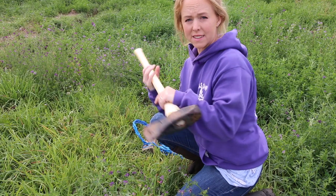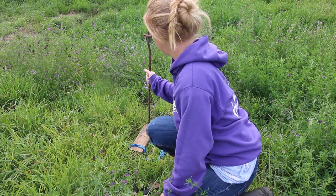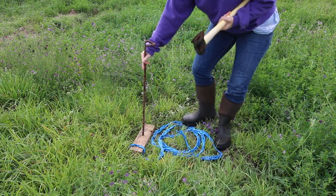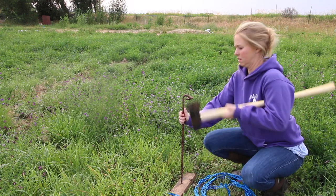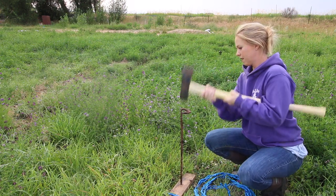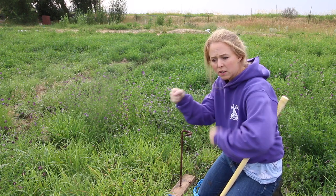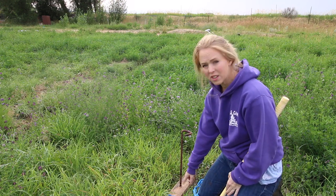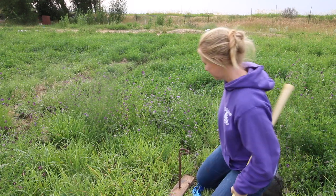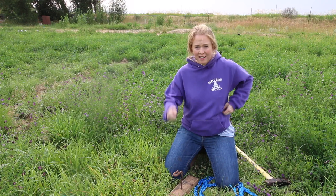Okay, so I use an old axe that's already broken on the back — it's easier for me to lift than a sledgehammer. I always do this right after we water so that the ground is soft, because we have so many rocks. If you try to swing too big of a swing you're just going to bend your rod — you have to pound it in a little bit at a time and let it get around the rocks. We can't use those screw-in rods here just because of too many rocks and then it won't hold in place. These really long rods work really well, and even though it had that little bend in the bottom it doesn't really matter — it's going to bend a little around those rocks anyway. Sometimes it helps to change your position so that the axe is coming at it from a different angle. And that should be good — we're good to go.